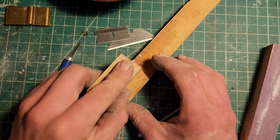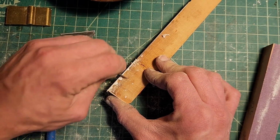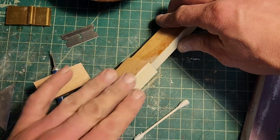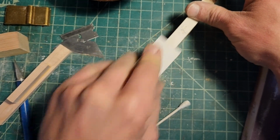I was almost ready to put them back on the key bed and see how things looked, but not without a lot of sanding first. I ended up having to sand the tops of most of these repairs all the way up to 1500 grit before I hit them with the buffing wheel.